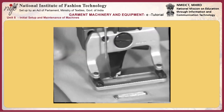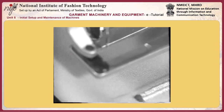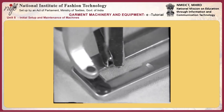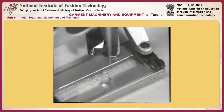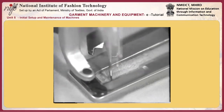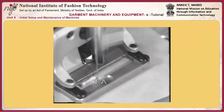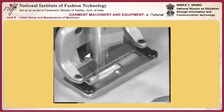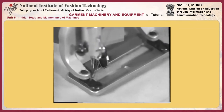22. Then, adjust the overlapping amount between upper knife M and lower knife N. If the overlapping amount is not enough, the clamping force of the upper and lower knives will be reduced to cause needle thread slip-off. If it is excessive, the presser bar lifting lever will fail to move smoothly. The most desired overlapping amount between the upper knife and lower knife will be provided when the end face of needle thread presser spring O is flush with the end face of upper knife M.